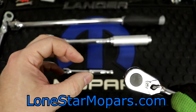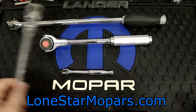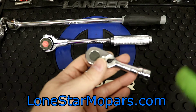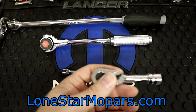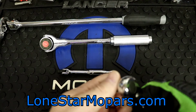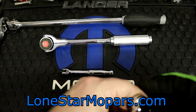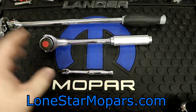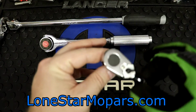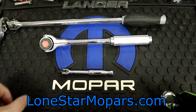What I mean by that is if we had a nylon lock nut and a bolt here. I was using, in fact, this ratchet, not this one but the exact same thing, at work Friday. Didn't have access to an airline, so I was using that to run some fasteners in. If I had, say, a Harbor Freight ratchet, insert other ratchets here, I could start to turn that, and I'm going to have to hold the nut. That's just the way it works. I can get it going, spin the ratchet around, and then it catches, and yep, we've got resistance, we can tighten it down. With the Koken, you get it on there, and with the slightest little resistance, the thing starts to turn the fastener. It's a huge deal, because that saves me so much effort, so much time.